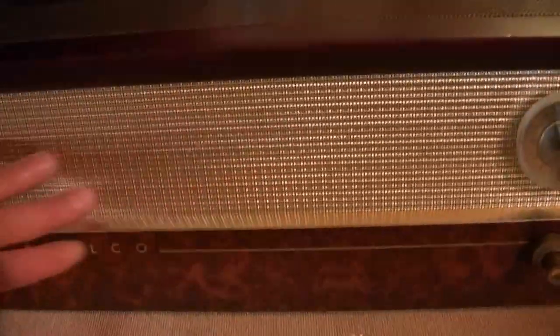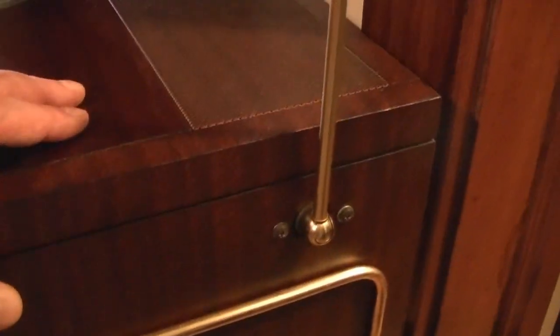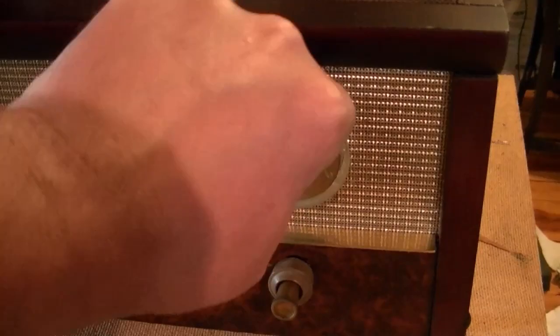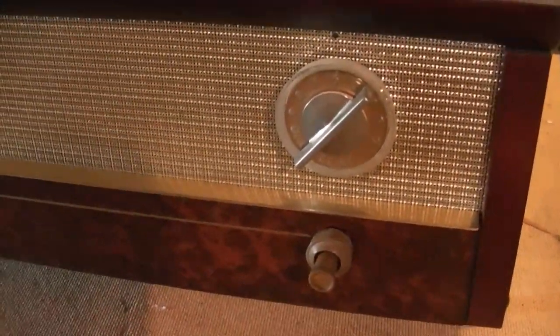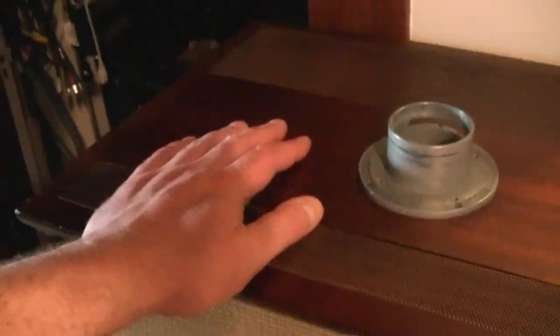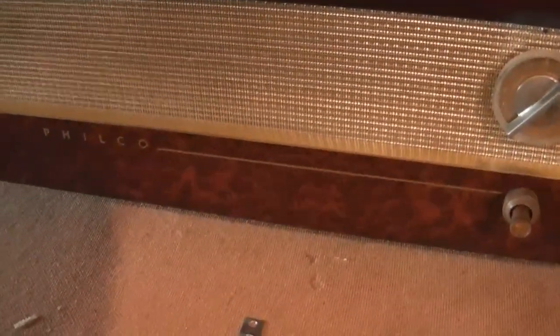It looks best when you're looking straight at it, but from the side it's much more noticeable — this side is lighter in color. Trust me, in person facing it straight on it looks pretty good, certainly a lot better than it did before I started. Here it is with the chassis reinstalled and the CRT mount — there are those nice new plated legs, cleaned-up grill cloth, the knobs — these are reproduction knobs — and there's the antenna. I still have a little more work to do: I want to align it, then remount the picture tube, and do one final video on this set and finally call this project done.